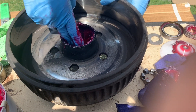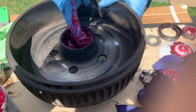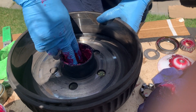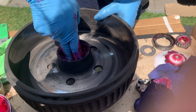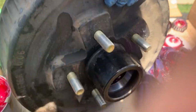Basically you're putting a healthy amount of grease all over the inside. Grease does two things: it lubricates so the bearings roll more smoothly, and it also reduces heat. When the lubrication breaks down due to water, dirt, or time, you're allowing more heat in, which is going to cause the metal parts and bearings to fail over time.